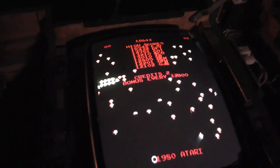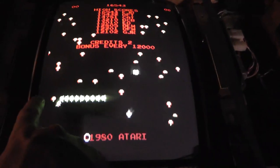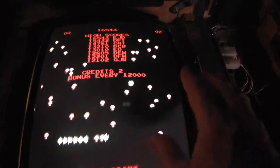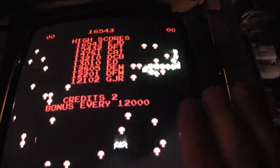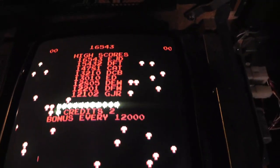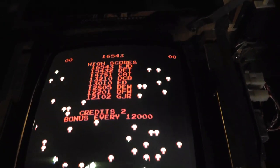It wasn't the EAROM. A lot of times people will replace the EAROM. So we still got some weird thing going on with the sides. Like I could adjust the monitor, but I don't understand why one PCB is set up correctly and the other PCB it's not. Like why is one PCB putting out a bigger image than the other? It doesn't make sense.